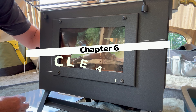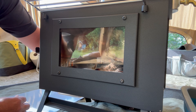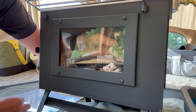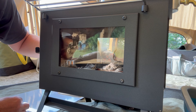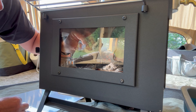I've fired this a few times and there's a little bit of soot build-up on the glass, which is completely normal. Just get a bit of kitchen paper towel, dip it in the white ash, and then just rub it on the screen. That's getting the majority of the soot stains off. For stubborn ones, you can use different cleaners - on the one at home we use a ceramic cleaner on the glass, but Robins recommend a diluted mix of white vinegar in water, which should help shift the more stubborn ones. It's as simple as that - just give it a quick wipe and you've got clean glass. You can always use the ash residue to help lighten the next firing too.